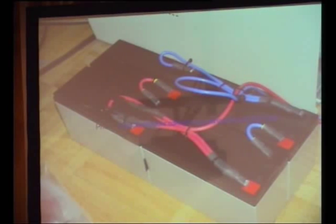So the battery's happy, and the only problem is the seals and the vents, because if something goes horribly wrong, it'll explode because you've got too much pressure inside, so you have to have a vent. They leak, and so you lose the hydrogen and oxygen if you keep the battery at high voltage, which is what your alarm or your UPS will do. That's why your battery only lasts a couple of years in your alarm.